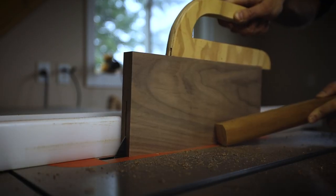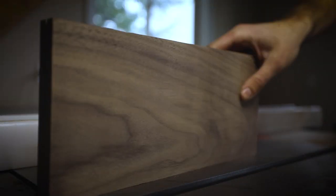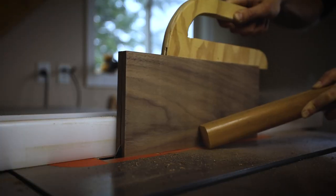As I was looking at other screens on the internet, it occurred to me there are three major problems I want to try and address. The first is size — it's very important to me that whatever I make here is not bigger than a couple of source books. That being the case, these panels have to be thin. I'm running my pieces vertically through the table saw right down the middle, then flip them over, take one more pass, and just like that one piece becomes two.